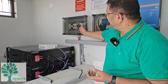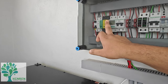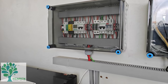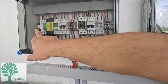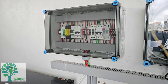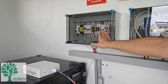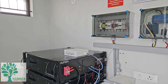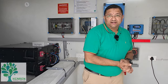We also have our ACDB — the incoming and outgoing AC distribution box. On the incoming side, we have an ELCB, a SPD, an over-voltage protector, and an MCB. The power from the mains can also be taken as input in case of emergency, but currently the ELCB is off so mains power is not going into the inverter charger. The system is running entirely on solar. All these boxes are IP65 rated and are from a company called Hensel. This covers the off-grid system here.